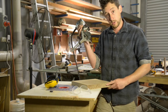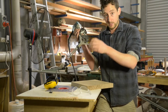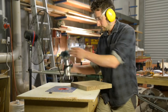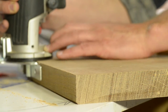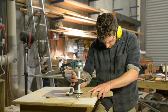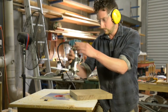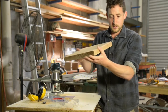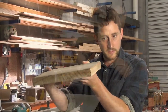The next cut I'm going to try with this little combination trimmer bit is still with a 45 degree bit, but it's going to be a straight cut down and then a 45 degree bevel out, because I've exposed that bit a little bit further into the timber. So it's created quite an interesting feature which, as I said, first steps down and then bevels out. I think it's a nice effect and should look good in a board like this.